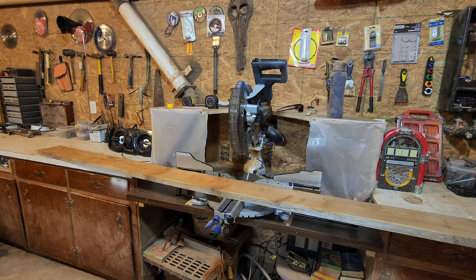Get my square, and what we're doing is a 4-foot swing. So the seat slats are going to be 4 foot. Now, when I build a swing, if I say it's going to be 4 foot, you're getting 4 foot of seat area plus the armrest width. Some swings, when people build them, 4 foot is the overall dimensions, and then you lose some of your seat.